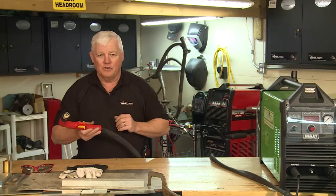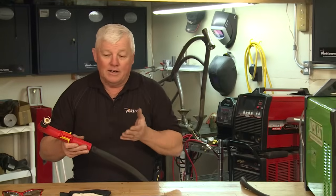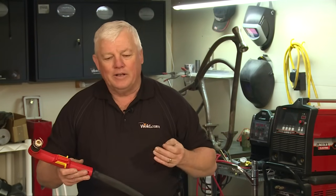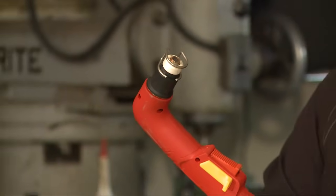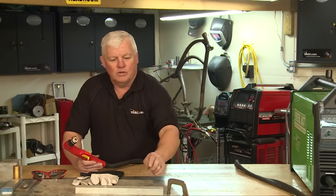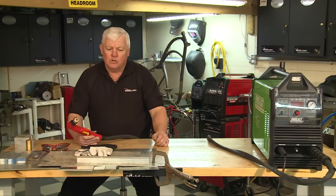There are a lot of plasma cutters out there, so just pick one that works and try it out, test it — that's what I'm doing right here right now. This particular unit is a 220 volt unit and it's designed to cut not only sheet metal but also up to inch and a quarter steel. I don't have a need to do that, so I probably wouldn't buy this for home use. I would go closer to light industrial, but nonetheless it's still a plasma cutting torch and I want you to look at all the components, because that becomes pretty critical. When you wear these out you have to go buy them, so you have to make sure your supply house carries them.